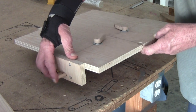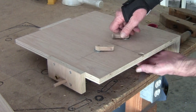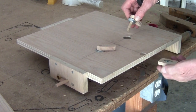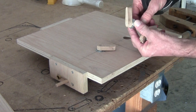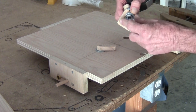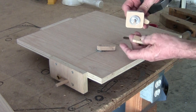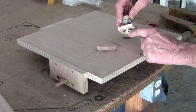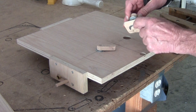and if you watch how it works, nice and smooth. Okay, let me show you the bottom of this real fast. What I had to do is there's a bearing. Okay, I got the bearing on here with the 3/8. Then I built this with another bearing that goes in here. This goes through, and then this connects onto that. Now I got a hole here to put my 1/8-inch pegs through here. Once I glue this, it gives it extra strength on top of it.